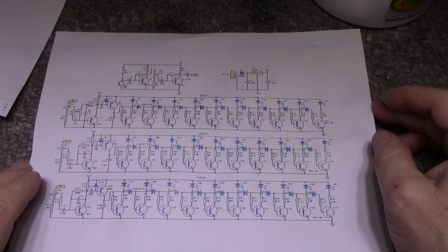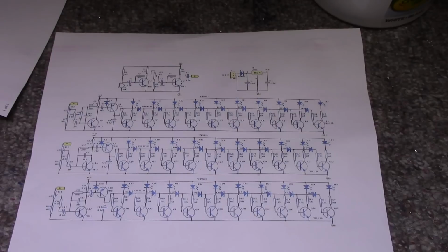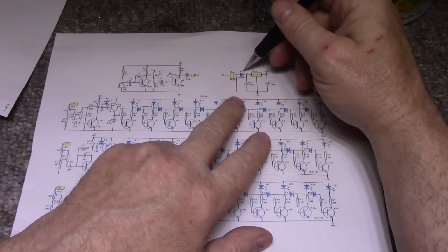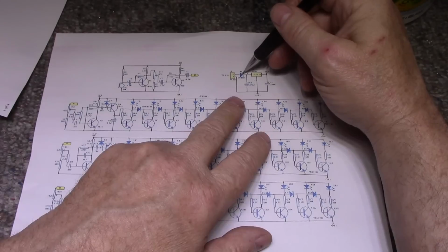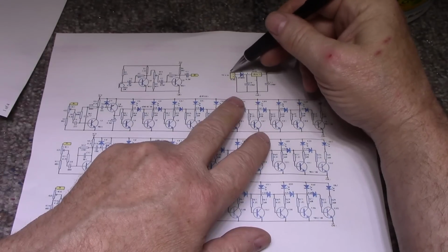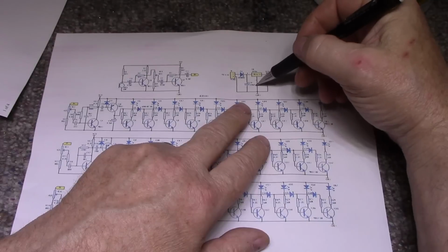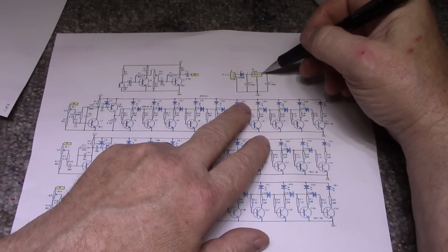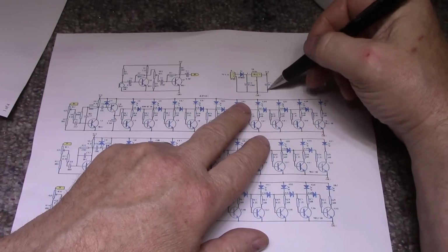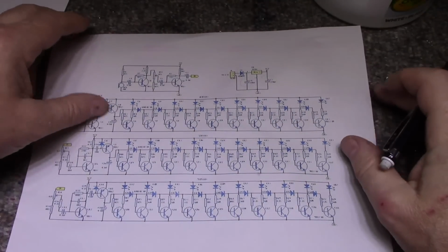This is the schematic I got from the AliExpress site, and we can go over it quickly. Up here we have the power supply. There's an input blocking diode, a reverse polarity blocking diode, so you can't feed negative inputs into this and blow it up. So this is protection here, and then it runs into a 220 microfarad cap for filtering, and then a 3-terminal regulator, and then another 220 microfarad cap, it looks like. So it's a pretty basic, simple power supply.